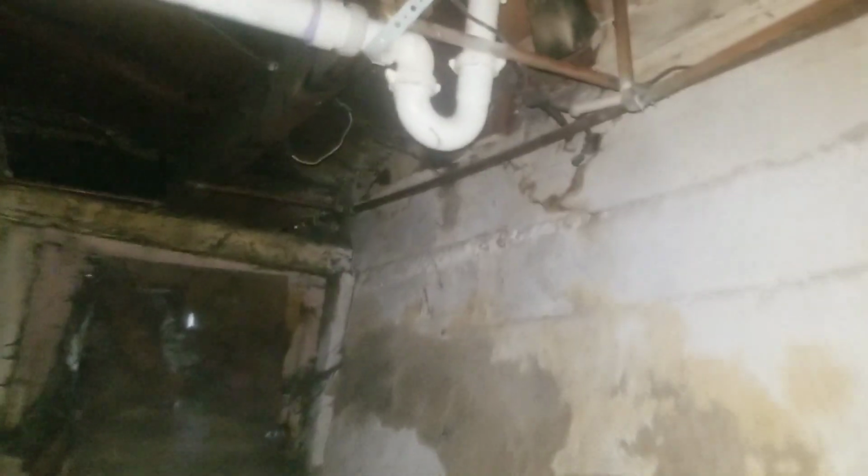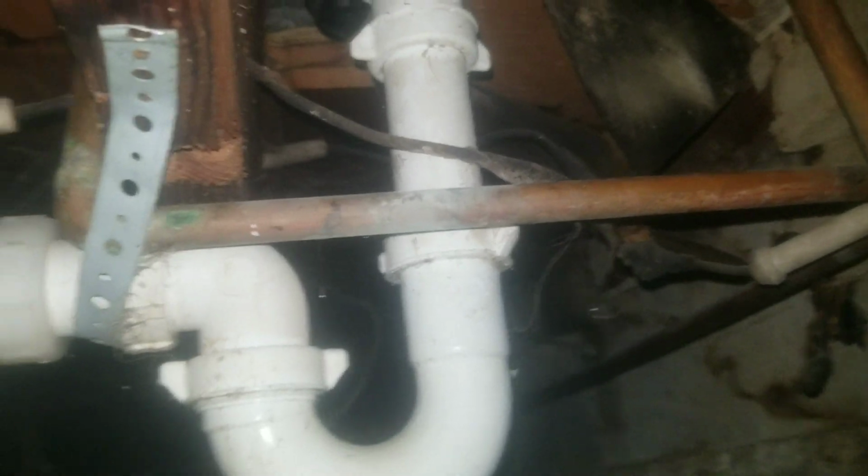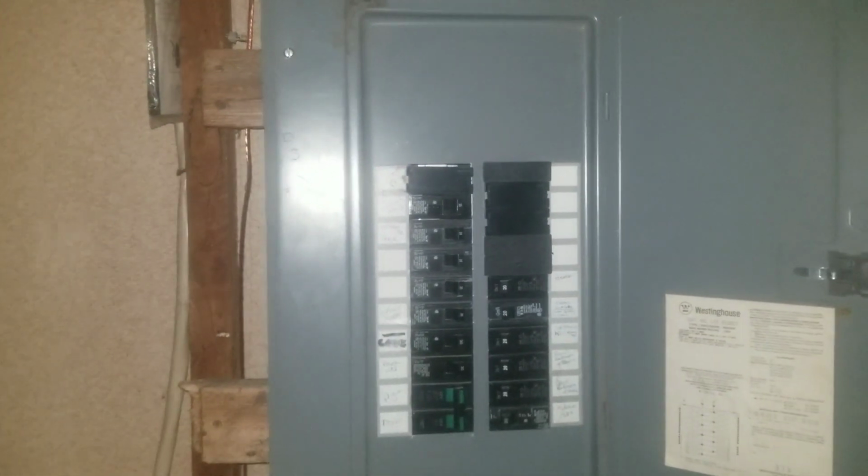Anyway, that's that. The electrical. This tub is going to need two electrical outlets. One for the heater and one for the pump itself. So electrical lines, this looks abandoned, I hope. So electrical lines, we can run those. Two of them, both of them GFCI outlets. It looks like there's space here. So you've got electrical and you've got plumbing before we even start here. Let's head upstairs.